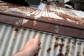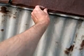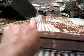It used to pull up, and then, there's a way we used to do it when we built pergolas. You get the end of roof sheets and you put a little dabble of silicon on the end. Say if this is flat and you want water to flow, you put a little dabble of silicon on the end like that, and it acts sort of like a wick and it just keeps flowing off. And I've done that on the end of that, but it sort of works, sort of doesn't.